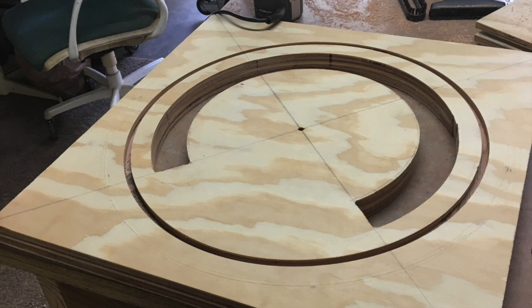Here you can see that I've got the slit cut out. What I did was I routed the outside and inside line. Then I drilled a hole and then cut it out with a jigsaw. After that I took a one inch flush trim bit with a half inch shank and routed out the inside making it nice and flush. The opening is one and a half inches wide and 270 degrees of an arc. I went a little beyond the normal 240 degrees. It was just easier to figure out, as you can see it goes from cross line to cross line.